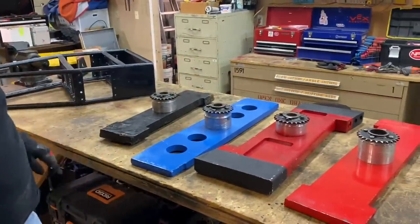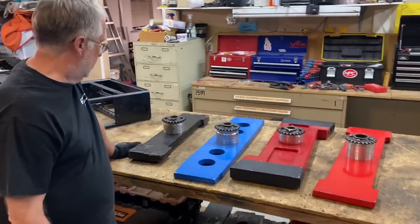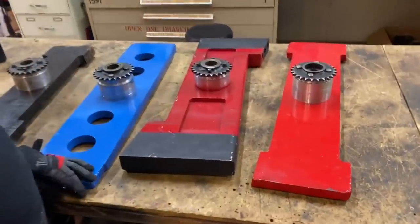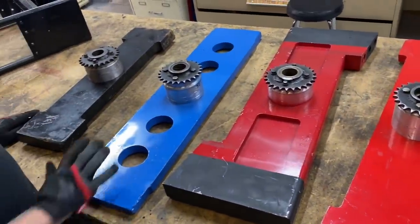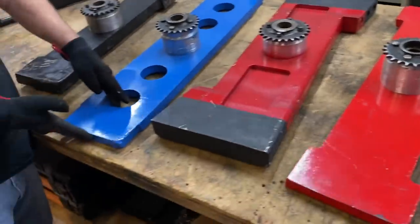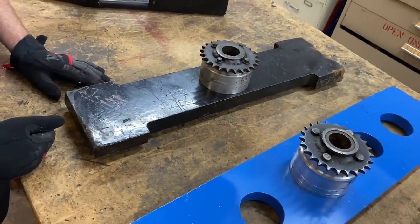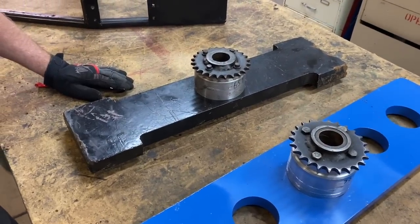So there's a reason they're shaped the way they are. It's a matter of trying to maximize the moment of inertia. All the weight out at the end — you can just hit harder for the same amount of weight. In each of these, they're machined in shape based upon that. The thickest portion of the weapon is out at the end, so it's higher moment of inertia. We actually have extra pieces there. It's just a way of maximizing the impact when you hit somebody. You've got to hit them hard!